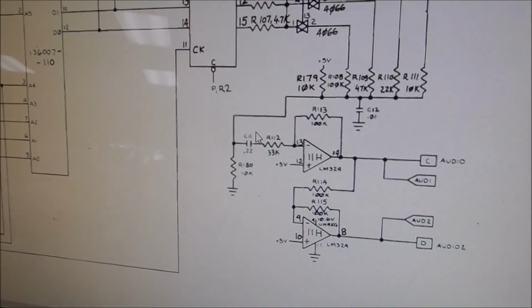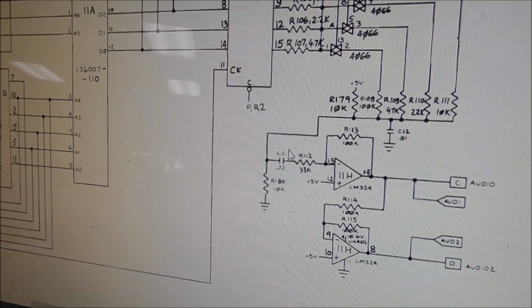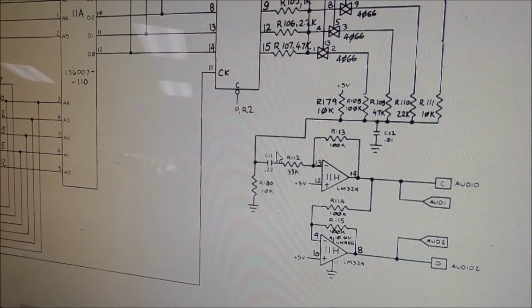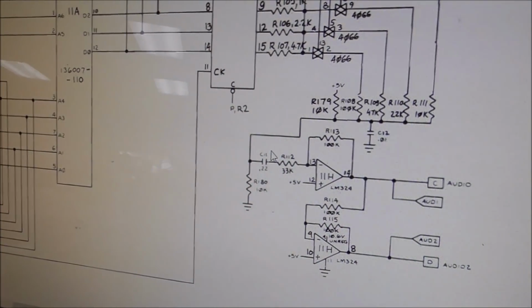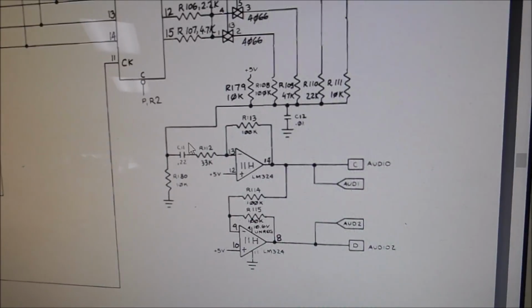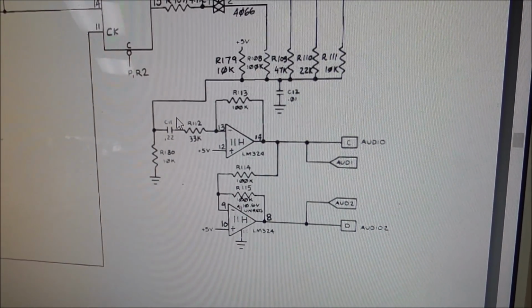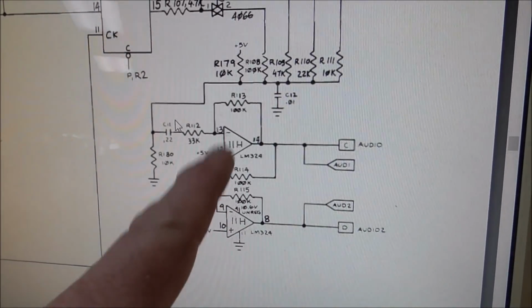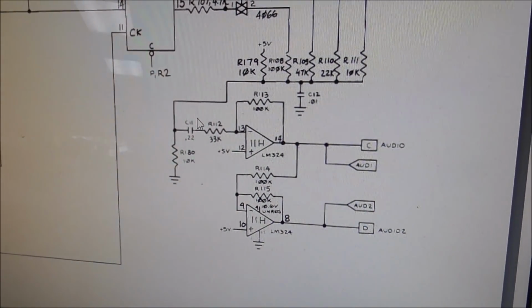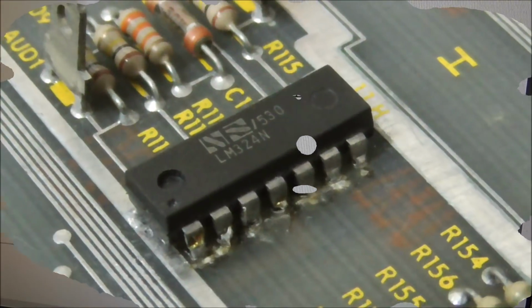Well, if that's a ROM, I don't think that would make all of the sounds disappear. You can still hear them, they're just real faint. So I think it's an amplification problem, and so it's either this preamp or, in my opinion, both of the amps on the power supply, which it could be, but since you're getting a whistling and things, I think this is it. But I'm gonna check the voltages, and if they're fine, we're gonna look at this.